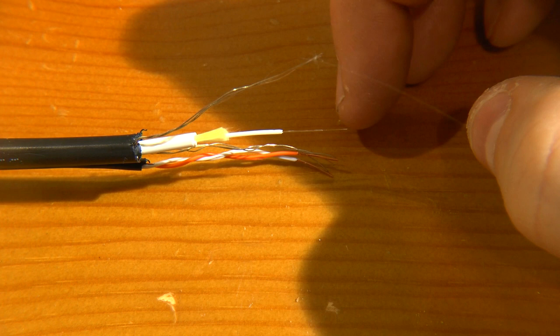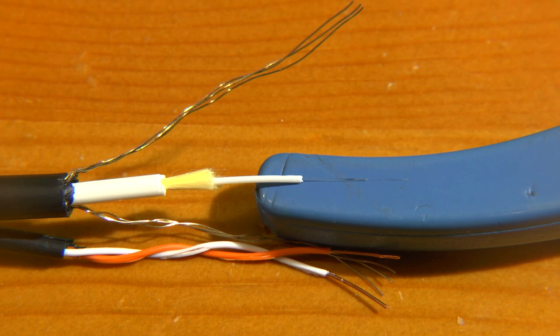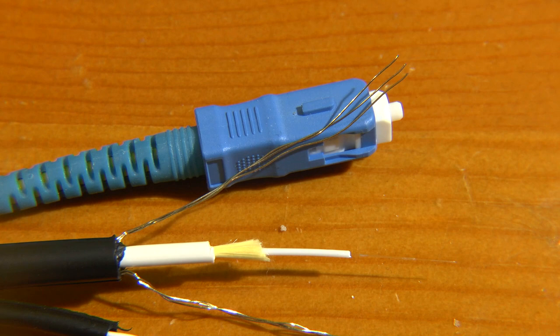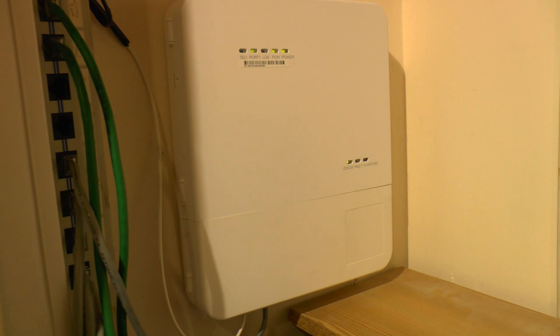You can see the fibre has a glass outer and inner core, and it's terminated in a plug which — for comparison — is about that size. Back at the box, the copper cable has just been tucked back up into the trunking and out of the way because it's not being used. If there was a fault with the other cable, it can be pressed into service — they'd just have to put a plug on the end.